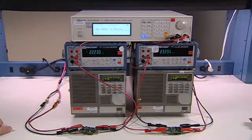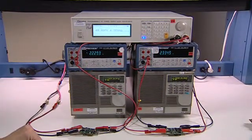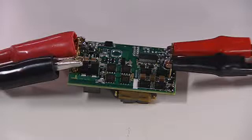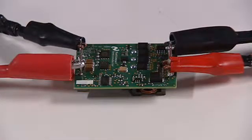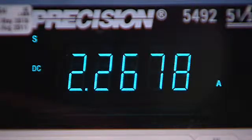What we have set up here on the bench is an LM5045 evaluation board. The evaluation board is a telecom industry standard quarter brick size. The input voltage range for this board is a standard telecom 36 volts to 75 volts, and the output voltage is regulated at 3.3 volts with a maximum load current of 30 amps. I also have an LM5035 evaluation board, which employs a half bridge topology, also in a telecom industry standard quarter brick with the same input and output specs as the LM5045 board.